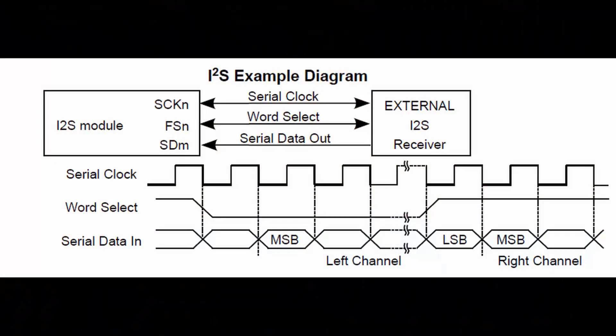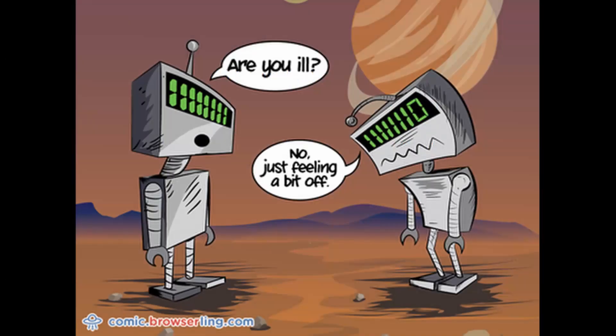That's the isolation covered. What about jitter itself? Inside digital devices, the digital data is handled in a format known as I²S. This is where you have separate lines carrying information: one line carries the ones and zeros — the data itself — but you also have a master clock responsible for the overall timing, and a word clock on a separate line that identifies packets of information. Digital data ones and zeros are called bits; eight bits represent a byte, and those bytes are packaged together into packets and sent along.